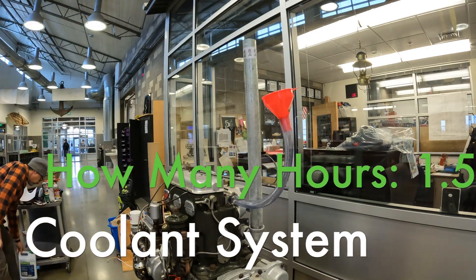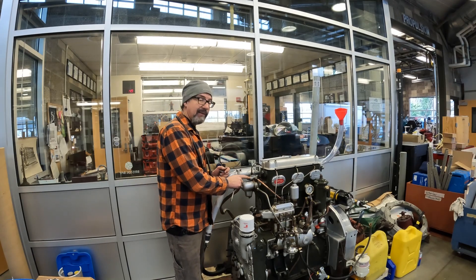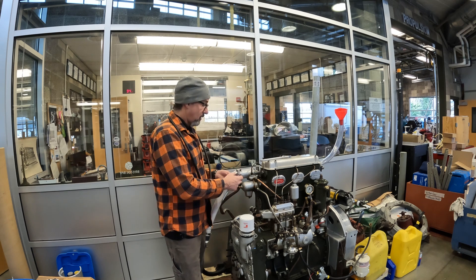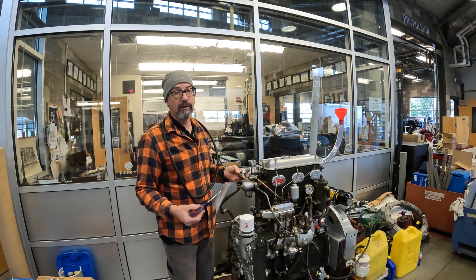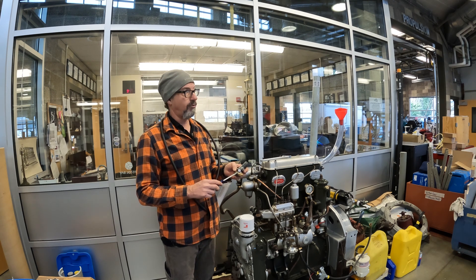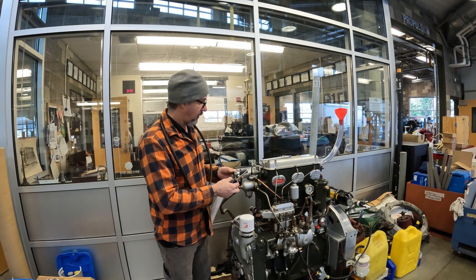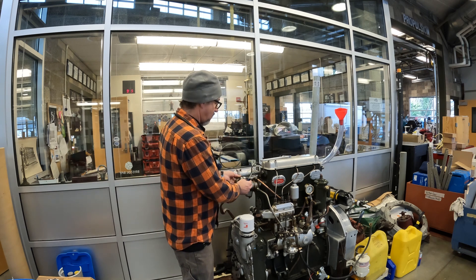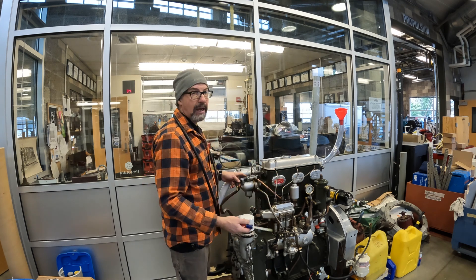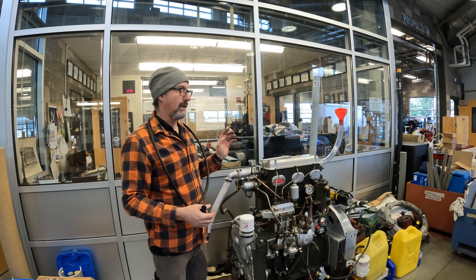One thing we had to do was get the return line on. I'm not sure what thread this is — it looks like it's made for a compression fitting I don't have. So temporary-permanent: we got a bronze fitting that had to go to a black iron steel fitting to a brass fitting to adapt it down to quarter-inch, just for the fuel return. The hardware store didn't have what we needed, but a little piece of five-eighths hose fits right over the threads and will serve as the return line with no pressure — it'll do its job for our initial startup, and we'll sort out the details before these things go into a boat.